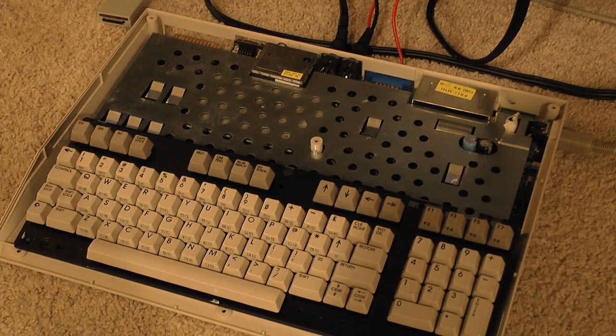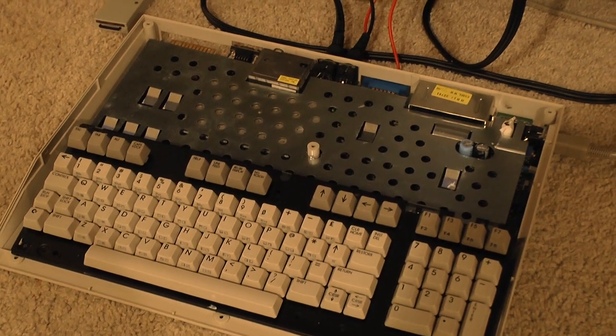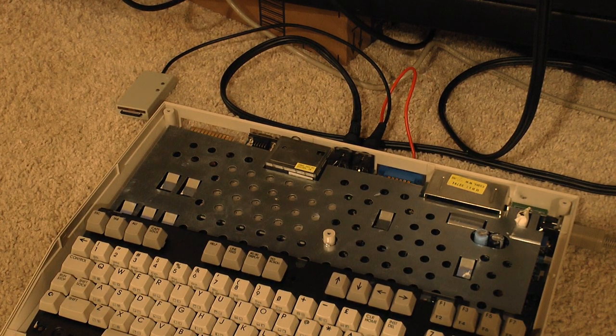So ultimately I have the keyboard working again, but to swap the chips has made the disk drive a bit unstable. I bought this SD card interface from someone in the UK, and I've seen it work once or twice now, but that other CIA chip has made things pretty unreliable. I almost wonder if it's a cooling issue. Maybe if I stick the chip in the freezer for a while and then plop it in the machine, it would work a bit more reliably.